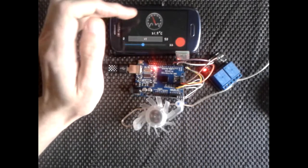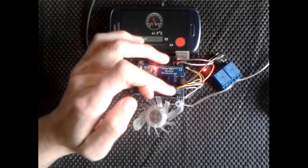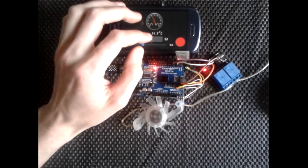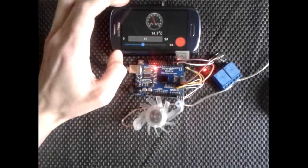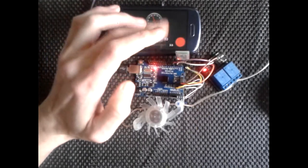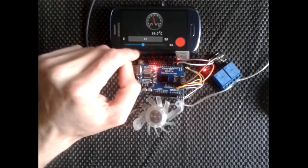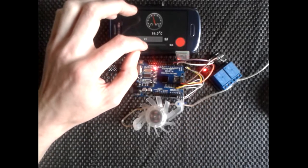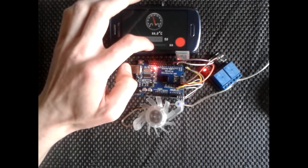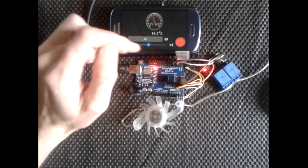I was saying before, I did actually say that these aren't actually communicating, but when they actually are, obviously it's sending the data from the BMP to this, so you can get the temperature readout. So there is a communication there. But what I meant by not actually communicating, I was talking about the slider value here. This is only ever sent the once when you slide it. I've done it so when you slide it, it doesn't change until you release, and that's when it sets the temperature. So it's gone to 29 now.